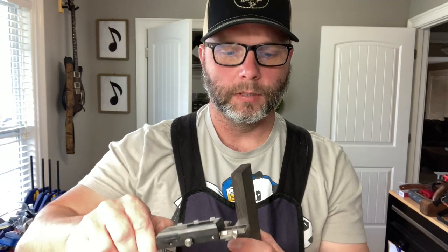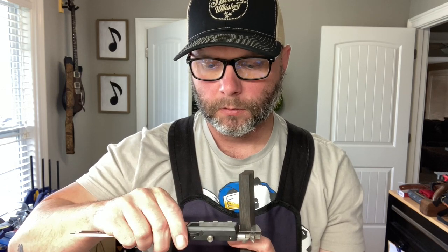I set this on a piece of granite that I know is flat. I zero it out, and then I push this down on top of the crown of the fret, and it'll read a negative measurement, which represents thousandths of an inch crown height. So anyhow, caliper. This blank from Stumac is 11/32 of an inch thick, according to this guy. This does fractions too, and I think I moved it a little bit, you can see. But in just inches, we're looking at 0.340, and that's 11/32.